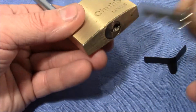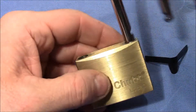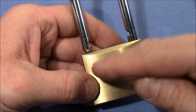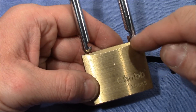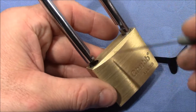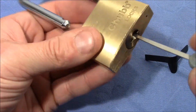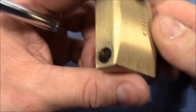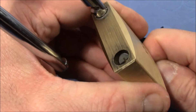But there is another method that has to do with the accessibility of the locking bar through the keyway. If you imagine that this lock was only locked up on one side — if there was no locking bar on the other side — the lock would open if you could pull on the locking bar on this side. Some locks are not shielded, and if you stick a knife through the keyway you can access the locking bar and pull it out of the way.